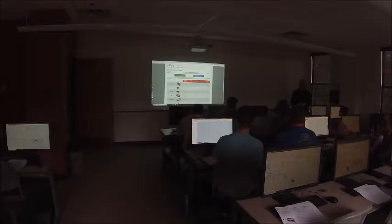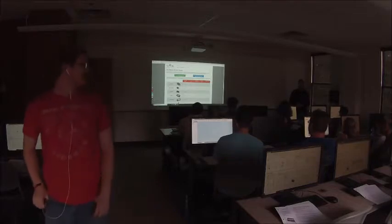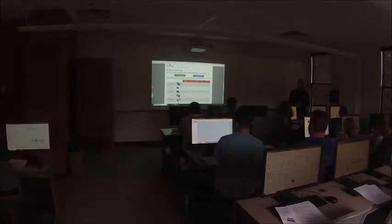And then in addition to that, we're using what's called a brushed direct current motor. So there are two kinds of, well, there's more than two, but there's two classes of motors, brushed and brushless. Basically, I'm not going to get into exactly how they work, but brushless motors are quite a bit more efficient, but they require really complicated electronics to drive the motor. Brushed motors are really simple. I mean, you can just hook a brushed motor up to a battery and it'll spin.